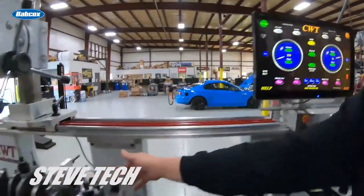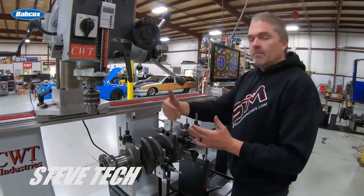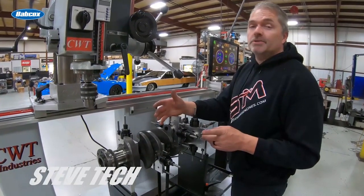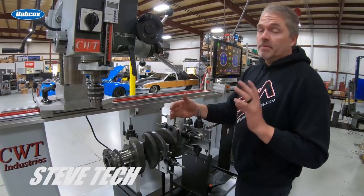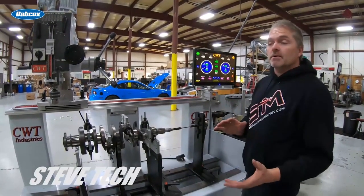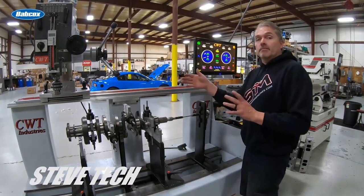It's always in a plane because we're working on two different sides. Everything is set up and the machine is ready to balance. We've already covered what our bob weight is, how we make it, what it means, and our over-balance and under-balance. We're using a standard conventional 50 bob weight. We're going to balance this at 500 RPM — that's the typical standard balancing RPM. If the machine is good, it will balance at 500 RPM just as well as at 700 or 1000 RPM.